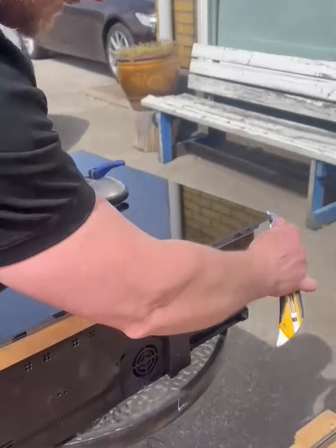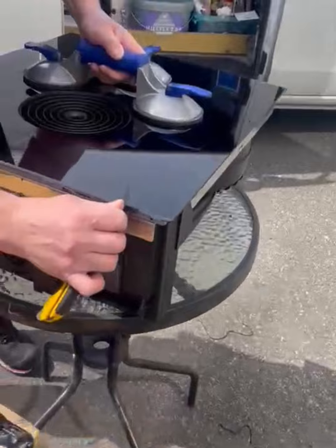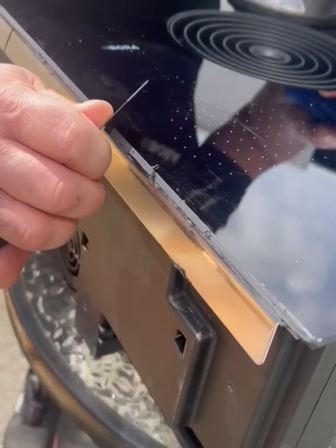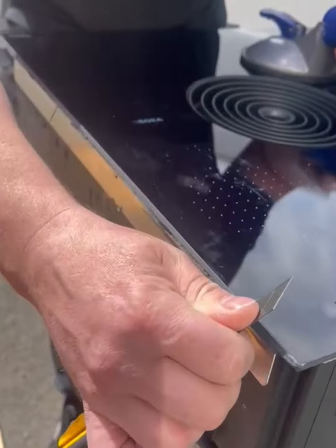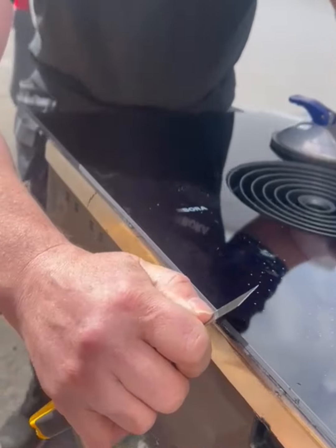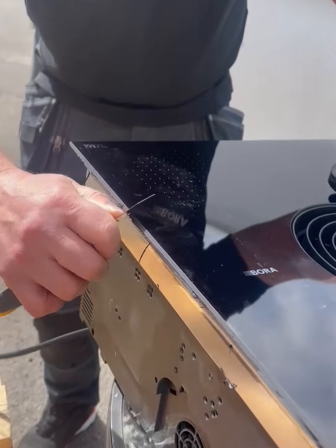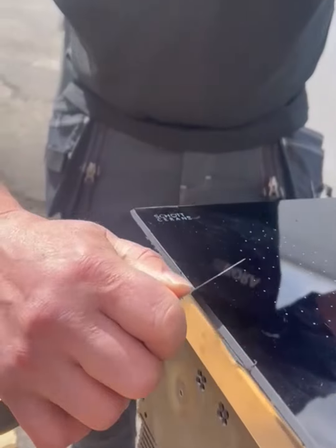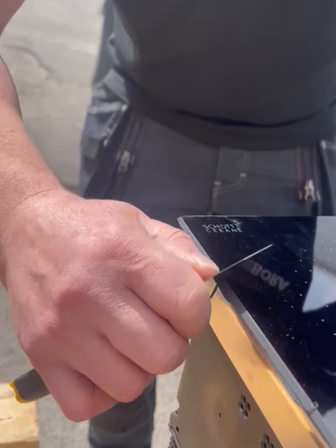To clean the glass, we start same as we've been cutting away. We take it very gentle. First, the top edge of the glass. Yes. We take a fresh blade where it's very sharp, and we just drive gentle on the very edge, because that's the very important place for later on to proceed.